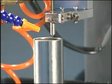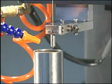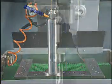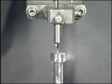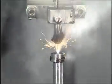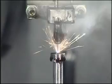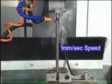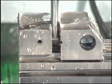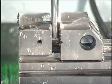TSH-3AA is used in drilling the initial hole of wire EDM and also for drilling hard metal materials. Its wide drilling range is from minimum phi 0.15 mm to maximum phi 6.0 mm. It only takes 200 seconds to drill a 1 mm hole on 200 mm depth material.